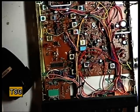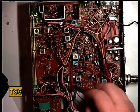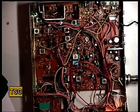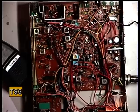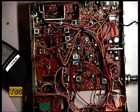Okay, so we've hit another snag with that - it won't come up in frequency. It's an adjustable coil which is T6 - T6 being the one just there. You've got the crystal there, you've got the coil there. The crystal must have dropped out of spec because it's about a quarter of a channel off frequency. So what we'll have to do is have a rummage round - this is where scrap chassis can be useful. It's not the normal 10.24 MHz crystal, it's a little bit further than that, so we'll just see what I can rummage with.